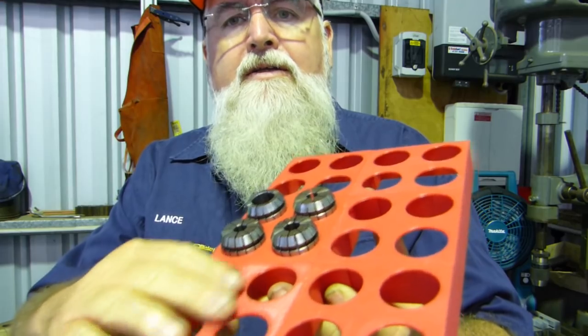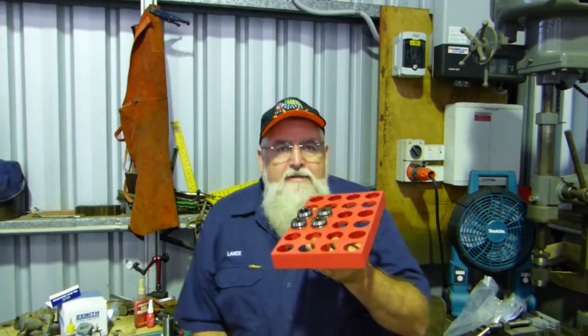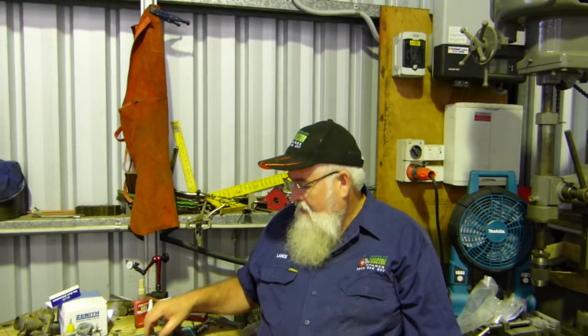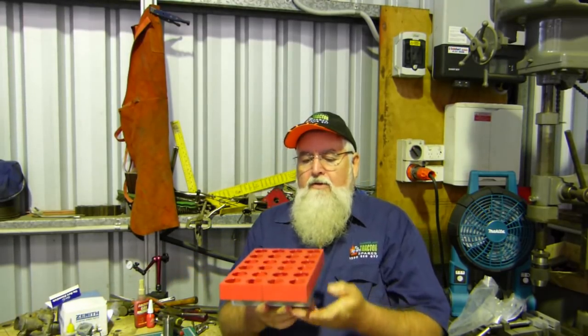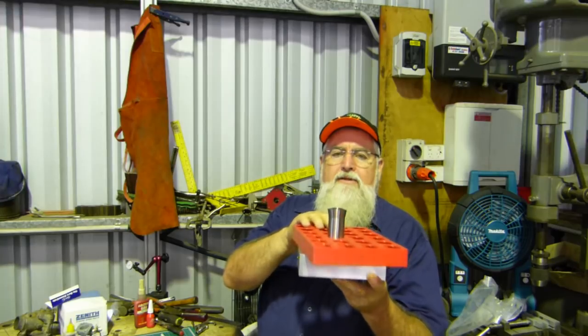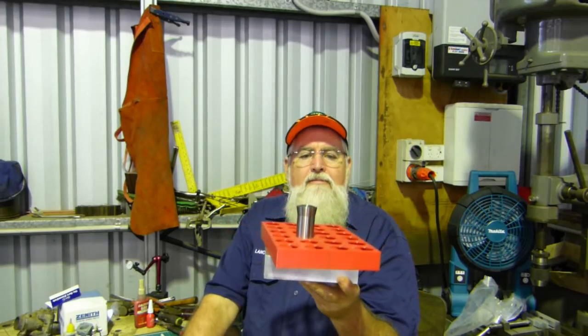It's got a slightly matte finish on the top and I'm liking that. The matte finish comes from the masking tape — I've been using masking tape on the bed and it's leaving a nice matte finish. I'm continuing down that way as it's a finish I can replicate right through the whole range. It doesn't matter what colour — I can end up with that nice matte finish. Another thing that's come to light with these collet holders: the 5C collets fit in nicely too, and you can open and shut your drawers and it's enough to support the 5C collets nicely. So I'm pretty pleased with that.